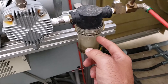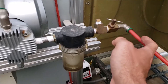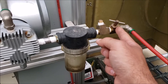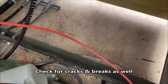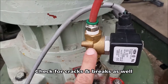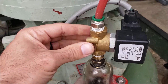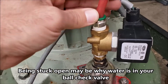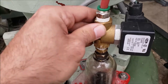You can unscrew this, drain it, and clean it. I had a small rag that got stuck in this needle valve and I troubleshot everything I'm about to talk about — it ended up being this little valve had a piece of rag in it that was causing no vacuum between here and there. You're going to check your tube for any obstructions. The next thing that happens a lot is your solenoid valve will either get stuck open or stuck closed, depending on a rag that got sucked up, too much corrosion, or if it's just worn out.